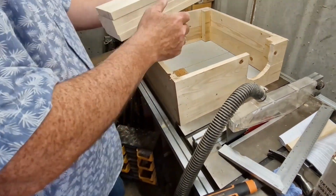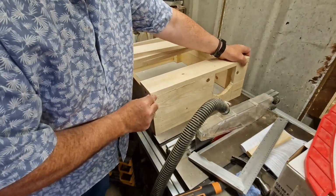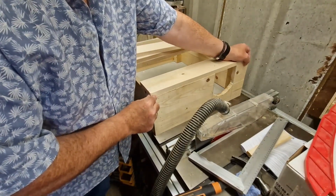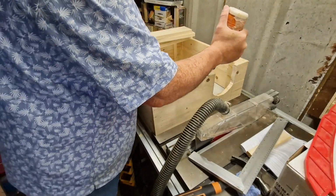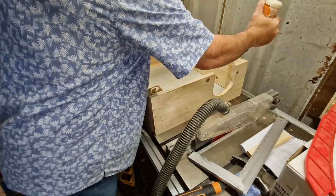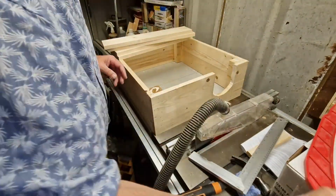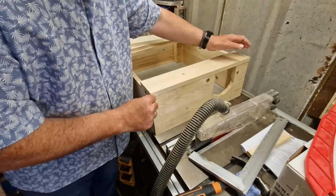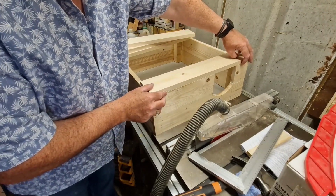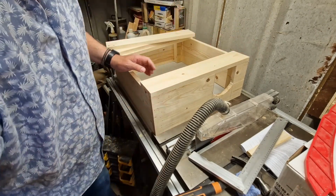So we've got the 50cm wood. That's going to make the base. So bead of glue and brad nail this on. Get that on nicely, make sure it's centered, level at the front and back, so it's good on the sides.